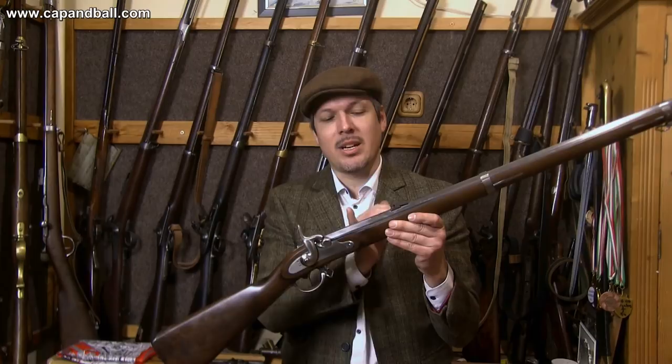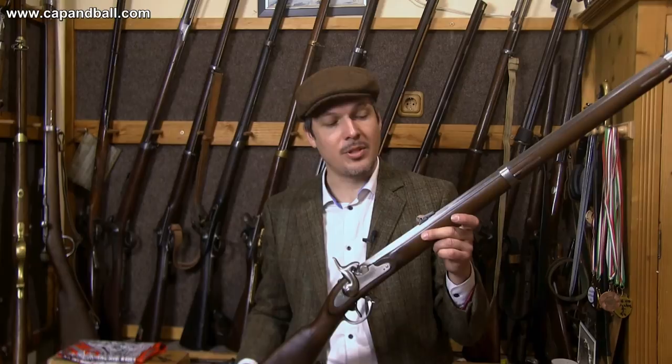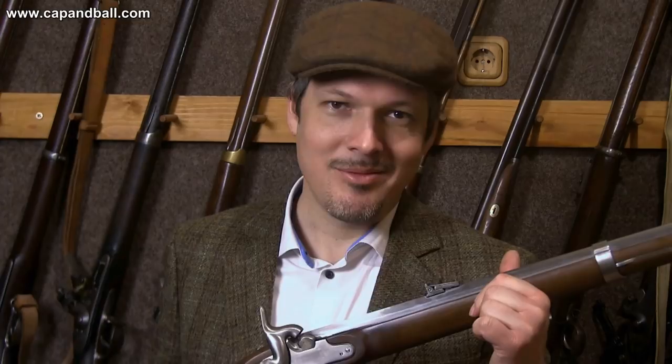Another very good feature of this rifle is that the sights are pretty far from your eye. In a Springfield rifle the sights are very close, so it is very hard to make a sharp picture. The Enfield is a bit better — the two-band Enfields have the rear sight a bit forward, closer to the muzzle. This one has a fair sight as well. The only thing I don't like, even on the original and on the Pedersoli repro, is that the V-notch on the rear sight is quite large. According to MLAIC rules — the international muzzleloading rules — you can change the size of this V-notch, you can make it smaller, but you cannot change its shape; it must be kept as a V. So this is what I already did — I glued a small sheet of metal on the back of the sight and remade a smaller V-shape notch to fit my eye much better. So ladies and gentlemen, how about trying this rifle at the range? Come with me.